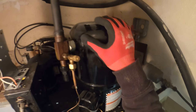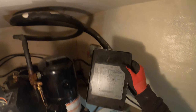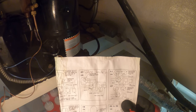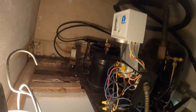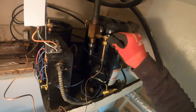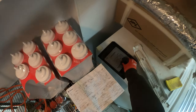While I turned off the camera, I heard this try to start — like a little buzzing sound and then nothing. It is hot. I am assuming there is power coming in, but we're going to confirm we have the proper voltage. I specifically use the probes and not the gauges with hoses at the initial service call so we don't lose refrigerant. When you put the gauges on, you always lose a decent amount of refrigerant that gets stuck in the hose.